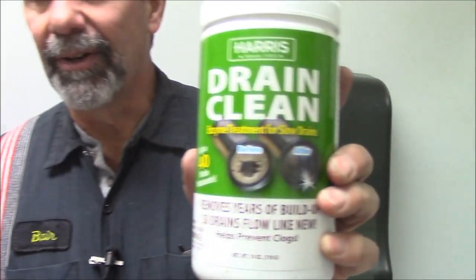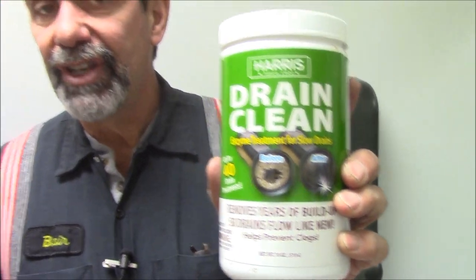When I'm in a kitchen with a disposal, I'll switch and I'll use an enzyme drain cleaner. It's going to work without the strong base chemicals that are in a typical high strength drain cleaner. It'll take longer, but this product still works very well. It's one of my favorites for cleaning a clogged drain. It's just the slowest acting. The product in our video here is a quicker acting, more instant gratification, open up your drain cleaner.